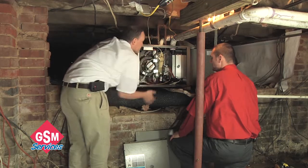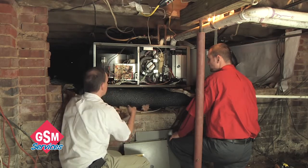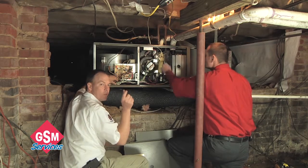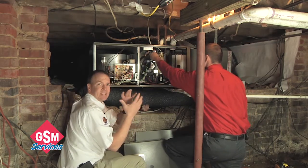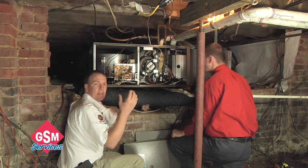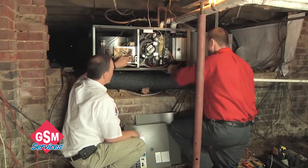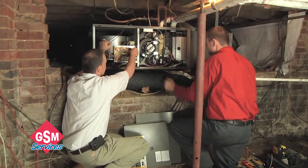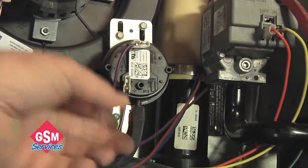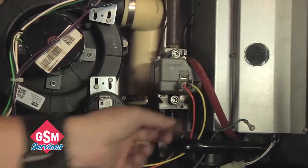So we've got that taken care of. The first thing I always like to check is all my wiring connections — I like to be sure they don't have any melted wire, and Jason's going to give them a nice little tug to be sure they're not loose. Metal, as it heats up and cools down, expands and contracts, and an electrical connection can get loose even from normal wear and tear. So we're checking all the connections to be sure everything's nice and tight, and inspecting all the wires for any burnt or scorched places, because that tells us the electrical insulation is breaking down and it may be time to do something with that.